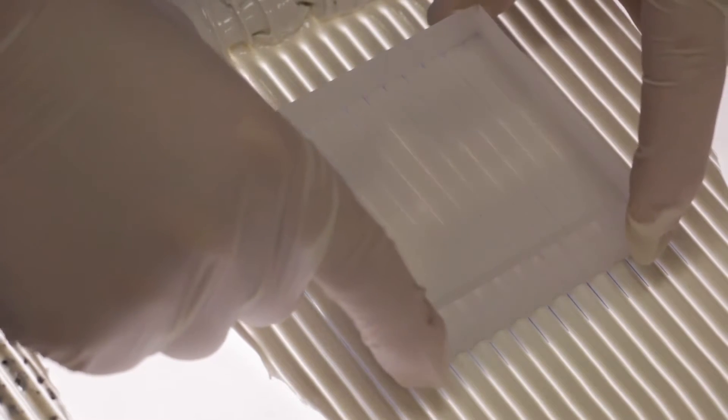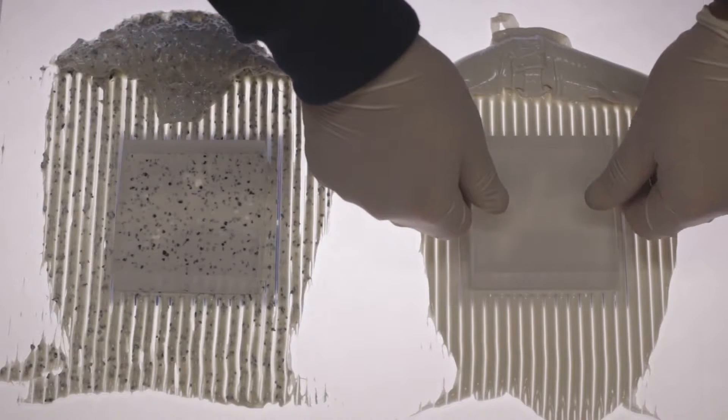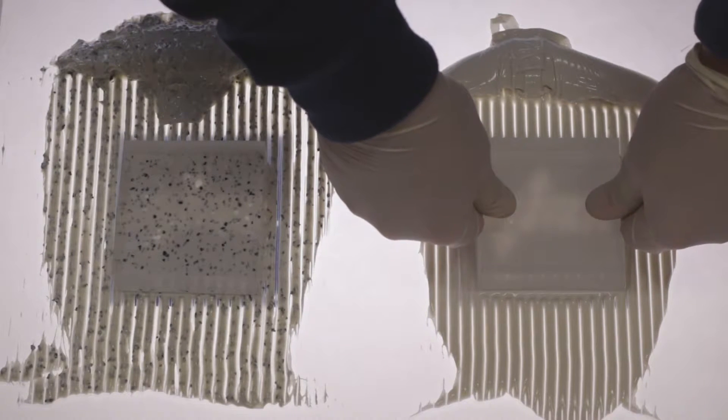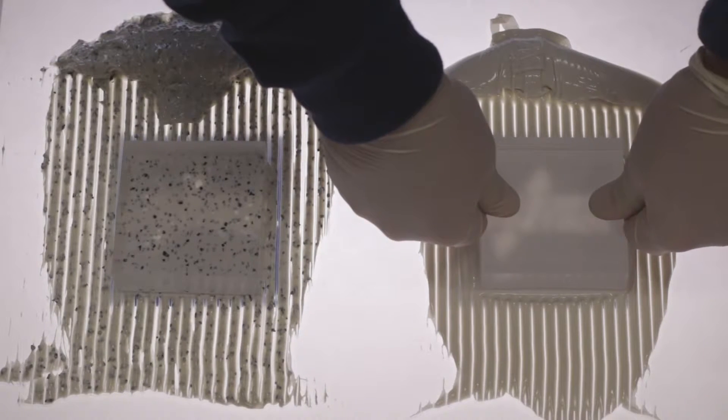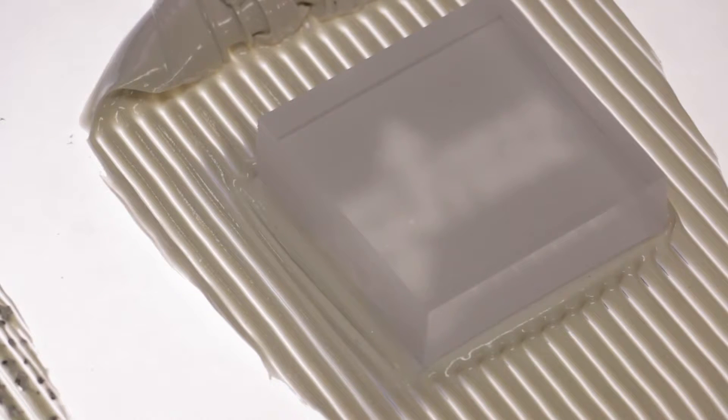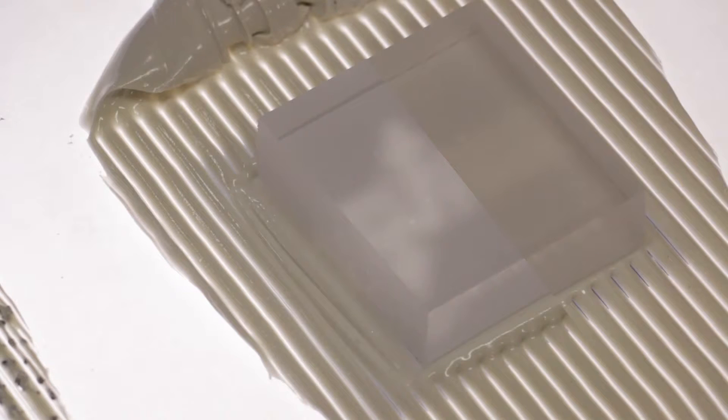If you don't have Thickness Control Spacers, the fluid from underneath the flooring keeps flowing as you continue to apply pressure. You can see the image get sharper as the fluid continues to move from underneath the board when you apply force. If the adhesive membrane is too thin, that can result in moisture damage and will reduce the effectiveness of the product in sound reduction.